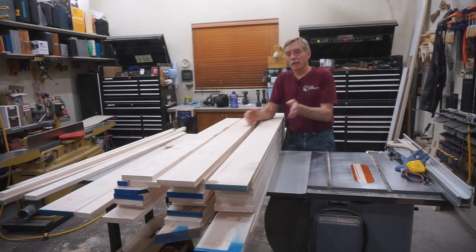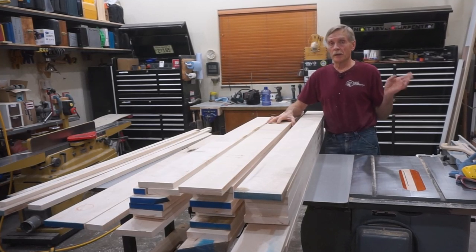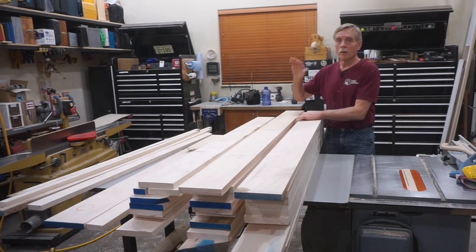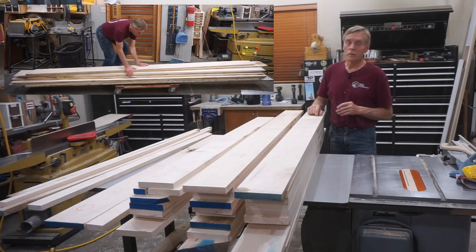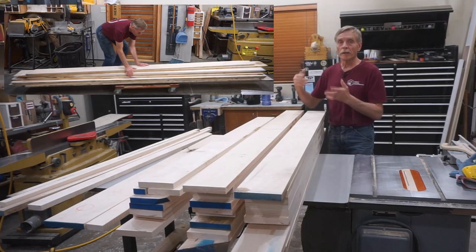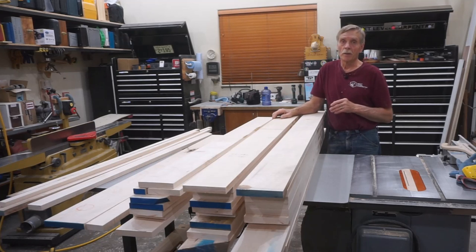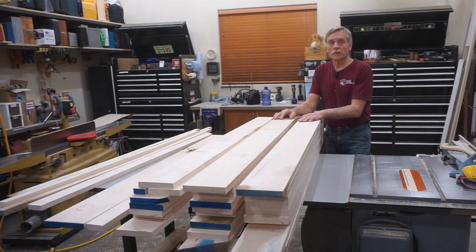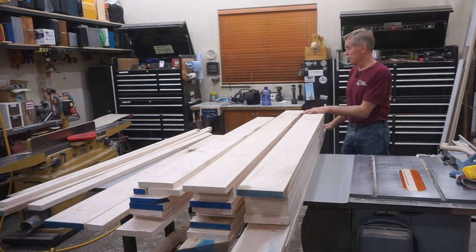In a perfect world I'd be able to buy blanks already five and a half inches wide to start at this stage. Depending on the material, you can buy one-by-six material at a big box store — it's five and a half inches wide — and bring it into the milling process at this stage. But I wanted to show viewers what this looks like starting out with that full pallet of wood, because at many hardwood suppliers that's what you buy, and you either pay them to do some pre-milling or you bring it into the shop and do that milling yourself. Either way, that percentage of waste always exists — whether you see it or not, it exists out there somewhere.